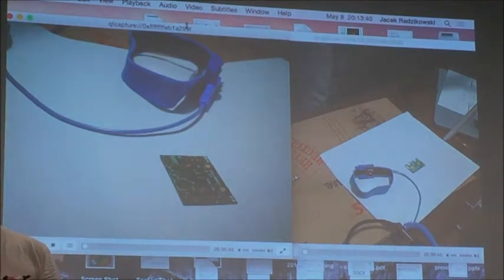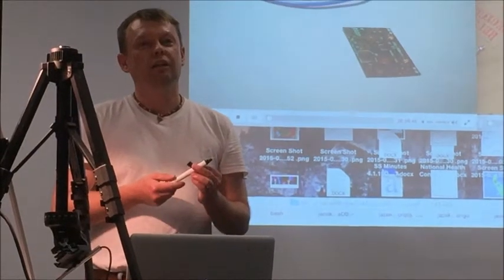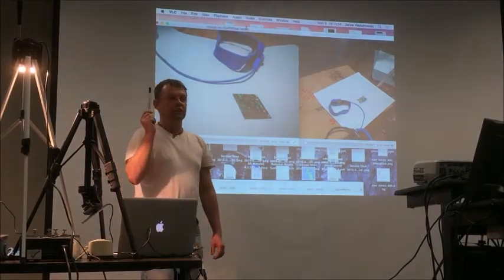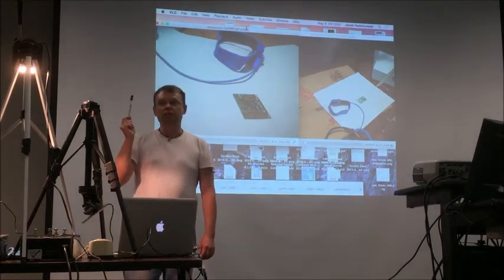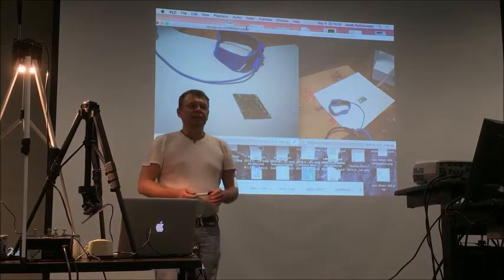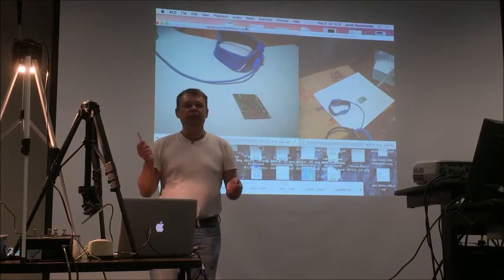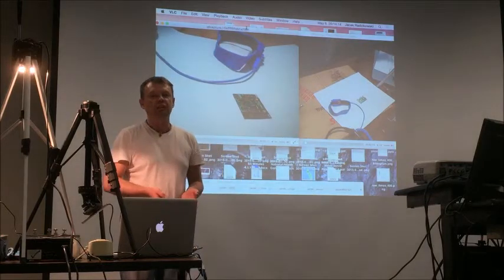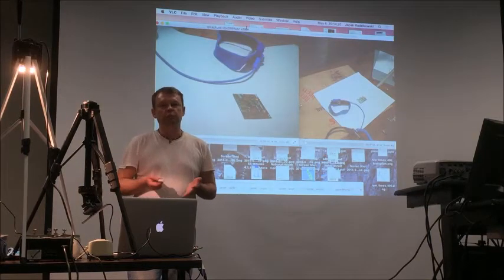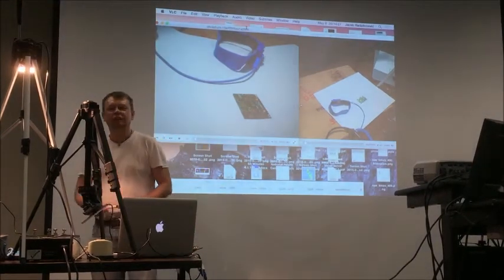This is MG Chemicals 8-3 or I think 3-5. This is not no-clean. You should clean after using this flux. So remember to clean. I have another one, no clean. This is total crap. Stays on the board for like 10 seconds. Well, people who work with BGAs, people who fix PlayStations, Xboxes, they love it because this is no clean, leaves pretty much no residues, perfect for use under BGAs. But for your everyday use, no, it's not good.